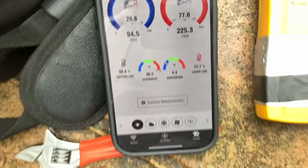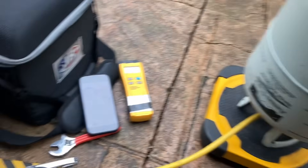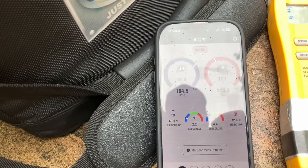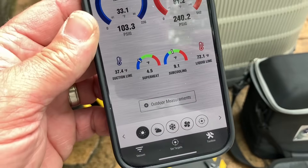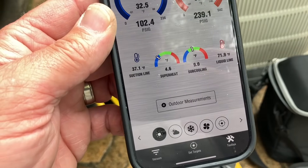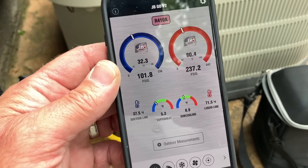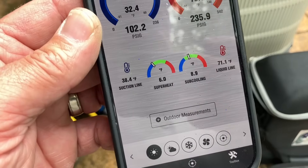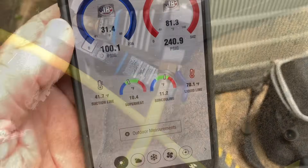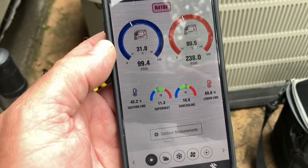We added one pound — we're at 4.4 degrees of subcooling. Going for two pounds. Charging as a liquid. Hopefully get some better results. 2.5 pounds, we are at 9.1 degrees of subcooling. Going right to three pounds — we'll put it at around 10 degrees of subcooling. Much better numbers. Evaporator — sorry, condenser — evaporator slightly over-freezing at 32.3 degrees. Condenser temperature 80. Not too shabby. Give it a little more refrigerant, go to three. 2.8 pounds, we are at 11 degrees of subcooling and 11 degrees of superheat. Not too shabby.